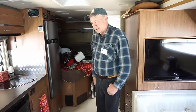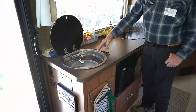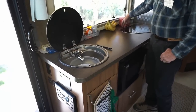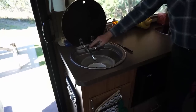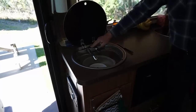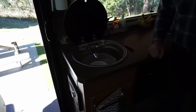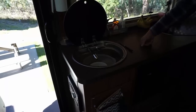Now that's how we did it to the bathroom. For the kitchen sink, you have a much closer circuit from the sink to the water heater, which is just below here. So when you activate the switch in the bathroom, you at least bring the water up to this point where it tees off. Now when we turn the water on in the sink and momentarily activate that switch in the shower, we only lose about two cups of water here till it's hot, because you already have your water heater warmed up.